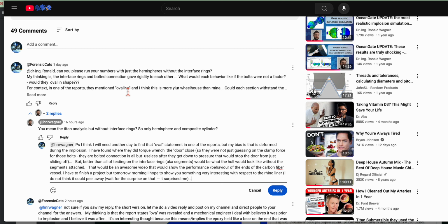Because the rings, we don't really know how the segments are shaped. You don't have the exact detail, so it's taking liberty. Yeah, it's got the profile of it. But the carbon fiber, that's known. The modulus of the materials, etc., from the glue to the Toray T800S.